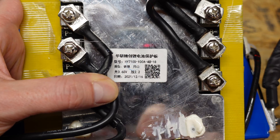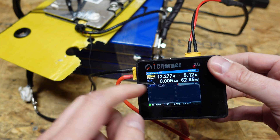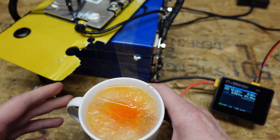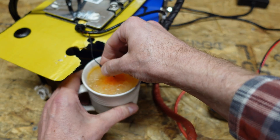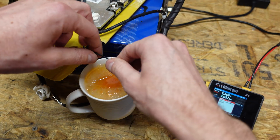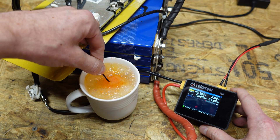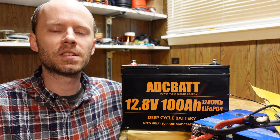The last test is low temperature charge protection. The charger is running at 5 amps. I have a glass of frozen salt water with orange-colored rock salt mixed in, which should be more than cold enough to trigger the protection. The cutoff was almost instant — maybe two seconds from placing the temperature sensor in the frozen water. That is really impressive.